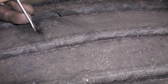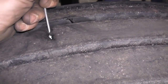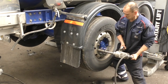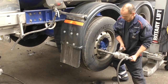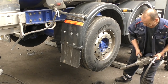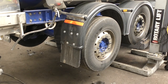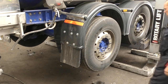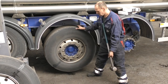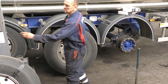I'll check with the depth of the tread and then go and feel to see if there's any cord showing - I can feel it so the tyre is damaged. Generally as HGV fitters we are stronger because the tools are bigger and everything generally is heavier. Very often you'll find guys are bodybuilders so they can cope with the job, or just to show off, and other times you'll find a skinny clever one who knows how to use leverage rather than muscles. But there is always opportunity to use big hammers, and this comes when the wheels won't come off. In this case it has a little slap and it's dropped off.